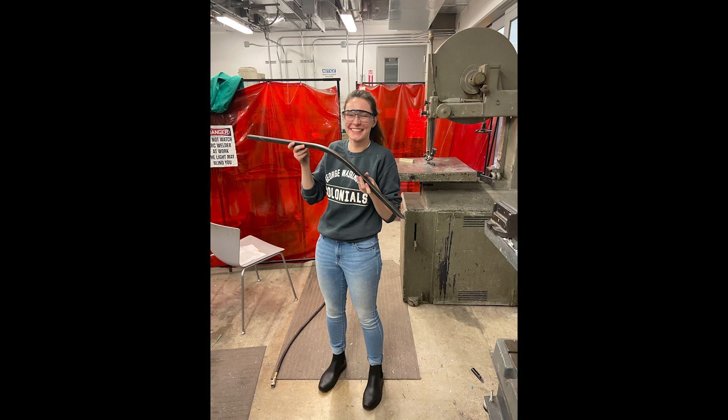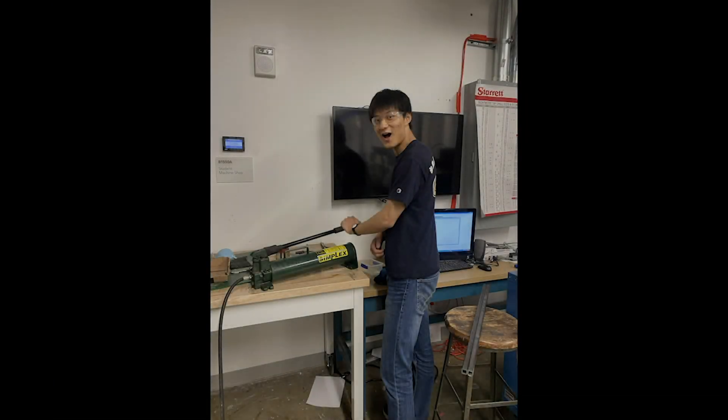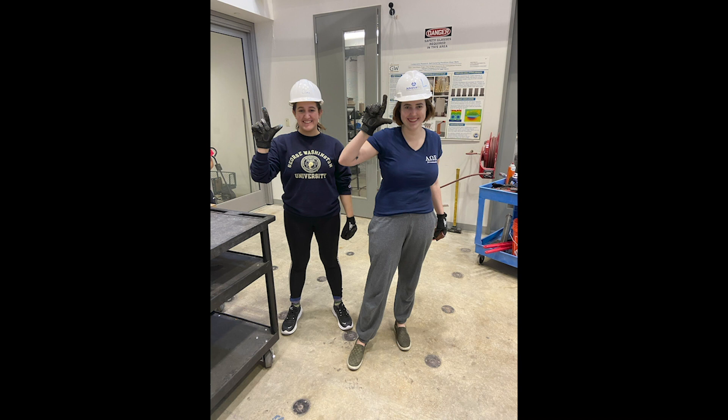This is the feasibility of our bridge structure. Portions of it use methods that at times can have pitfalls, but ultimately we thought it would be best to use cold bending methods as it is something we knew we could replicate often and that worked best with our overall design. One of our main factors as a team is making sure that everyone was able to be as part of the construction process as they wanted to be. Cold bending was the main innovative technique we used for steel rods, given the fact that it could be easily replicated from team member to team member and was used to create the X-shape in the structure. Because this method requires time and consistency, we wanted to maximize our time and use this method when we knew we could have it be the main focus of the day and involve everyone.